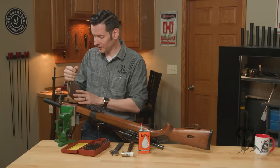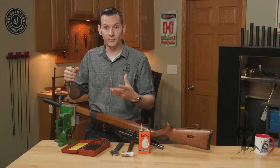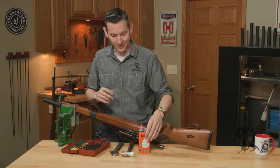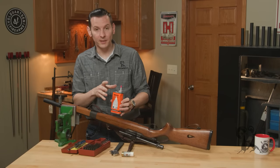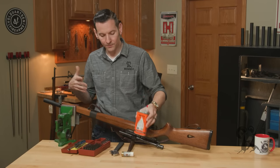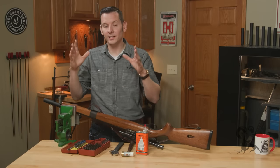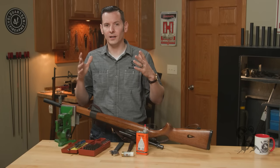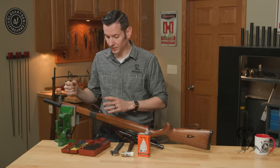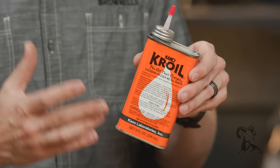Now there are scenarios where the screw may be rusted in, somebody used Loctite, or it's just really old and tight, and you have to use alternate means. Another good persuader is Kroil — a penetrating oil literally made to free stuck things. Put a little on the screw head; if you're not in a rush, give it a few hours or let it sit overnight. It'll penetrate down into the threads, break up rust, and give you really good torque so the screw comes right out. This is a must-have on my workbench.